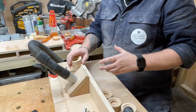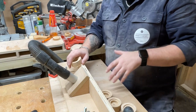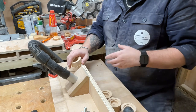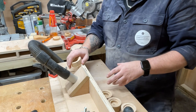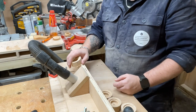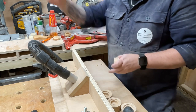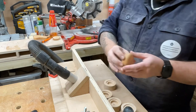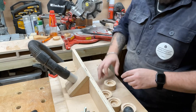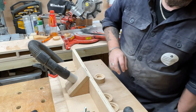I've got my router table set up. It's a very basic, simple router table with a trim router placed in it — it's an adjustable one so I can adjust the depth of the bit itself. It's also got a bit of a back plate as a fence. I've got it set up with a chamfer bit at the moment. Normally with these I do a round over, but I decided to mix things up and put a chamfer bit in instead. Let's give it a run over and see what it looks like.